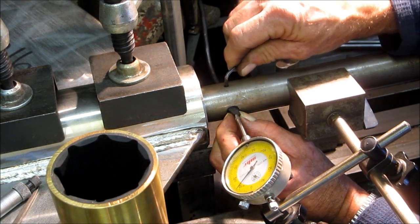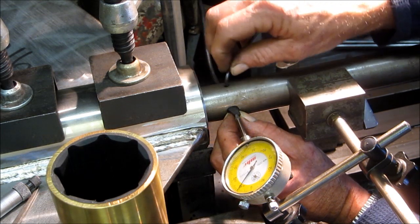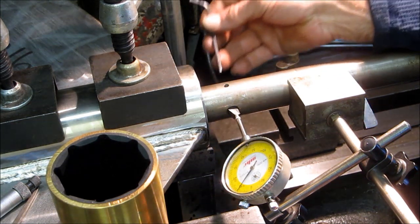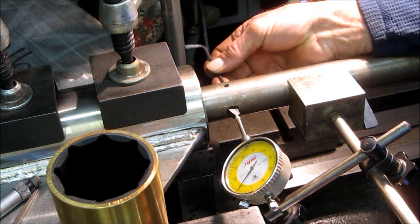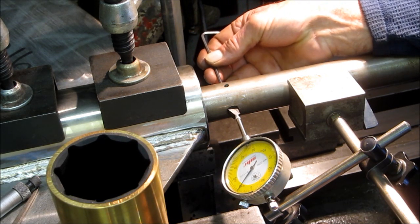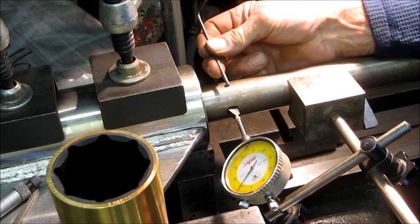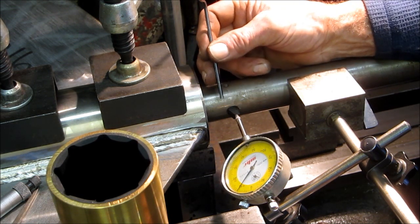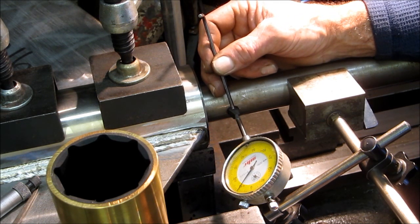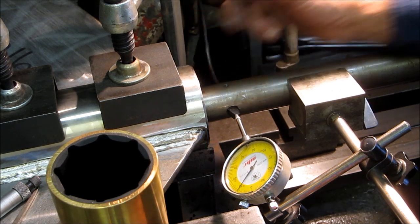And there's 10 there. You can actually see it move a little bit when you do your tightening and loosening. Some adjustments on boring bars like this, I could tap this side out, put a real fine threaded adjustment screw in here, probably Allen set, and then I can progress it in. But we're gonna do it the old-fashioned way, and that is setting your tool bit like that and work our way out to size.